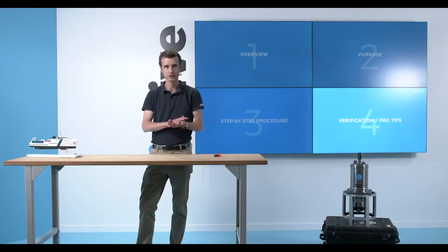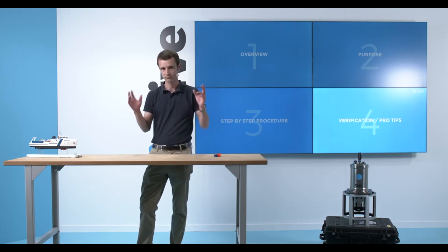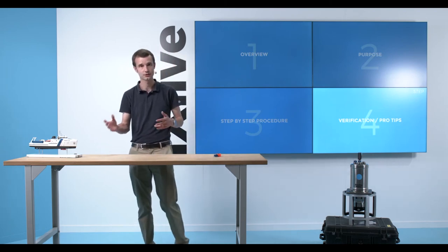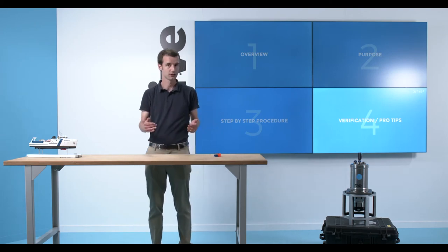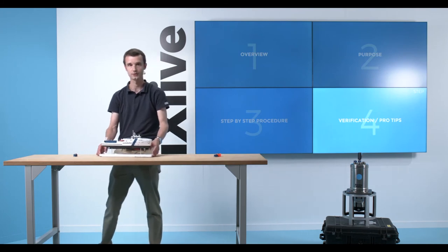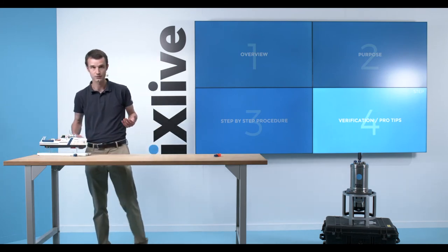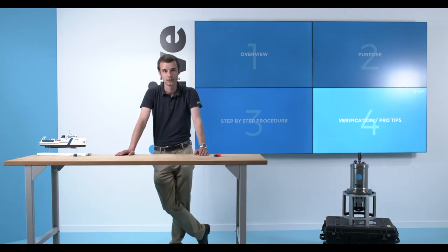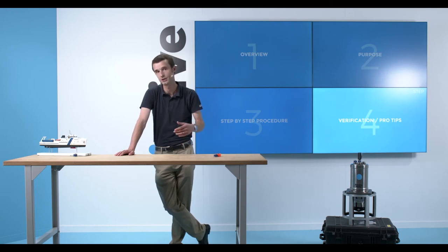If the calibration values or the SD are obviously wrong, let's say, 500 meters into the calibration line, something is probably wrong in your setup. So I strongly recommend stopping the calibration at once, coming back to the beginning of your line and figuring out what could be wrong in your settings. Most of the time, it could be about the sensor integrations, the lever arm of the GPS reference position, or things like that.